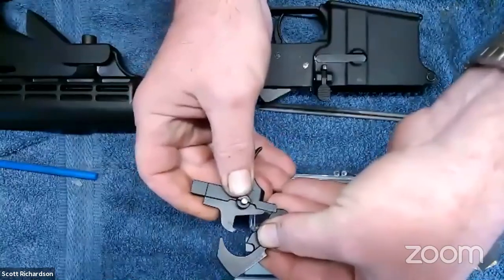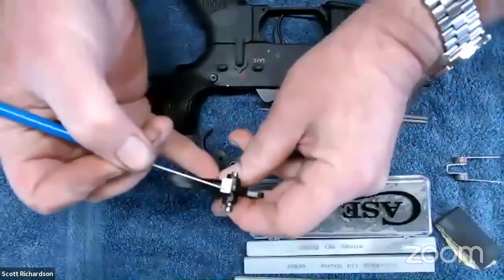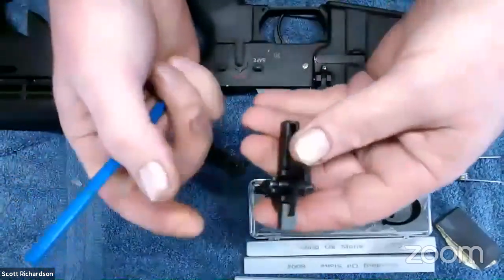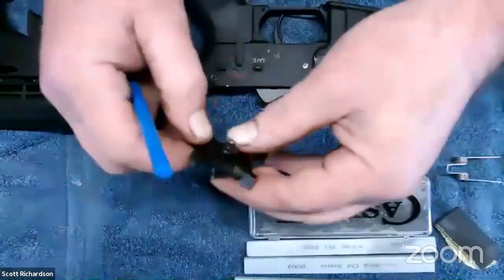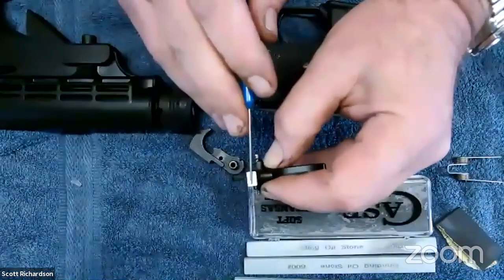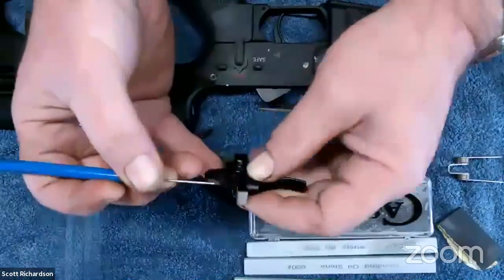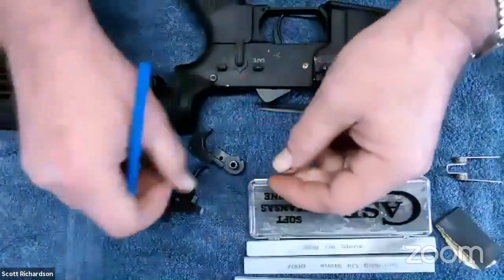So what we're going to do to make these better is smooth them. This face has machine marks in it — run a pick across it and it sounds like sandpaper. The trigger will function, but it'll be kind of gritty and crunchy as you pull it; it won't have a nice smooth take-up with a crisp break. We're going to polish this face and this face, but we don't want to dull or change this edge in any way. Whatever media we use, the whole area must stay in contact — I use an Arkansas stone and some oil stones.